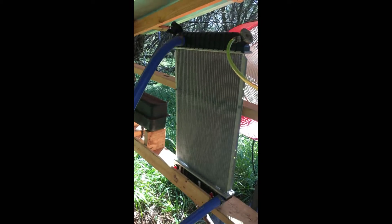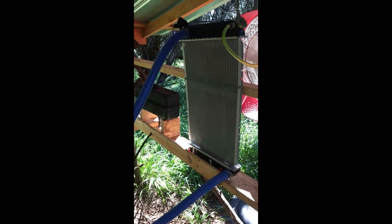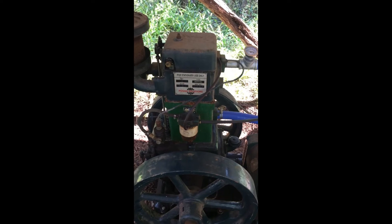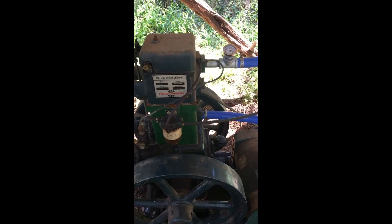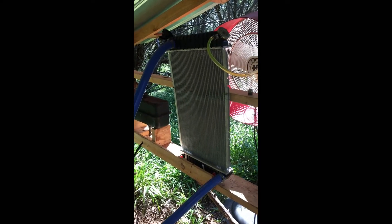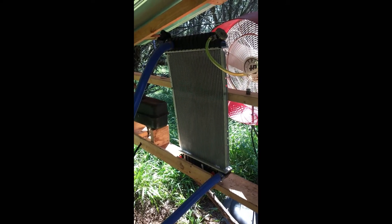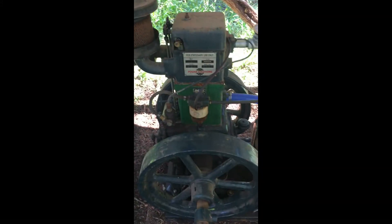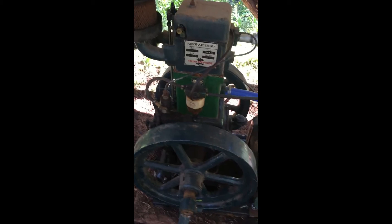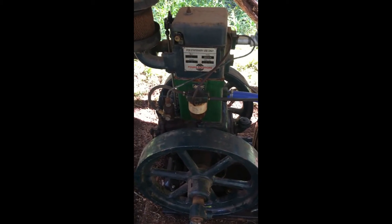I have it through a heat siphon to a radiator out of an S10 truck, and I just have a fan that blows on it right now. I haven't had any issues with it overheating so far, but I've had a very small load on it. If I do go with max load of 3,500 watts or so, it'll probably need a dedicated electric fan for the radiator, or a bigger heat sink of some sort. Anyway, I want to show you starting it real quick and then I can finish this video out.